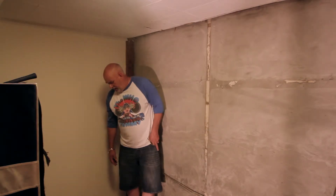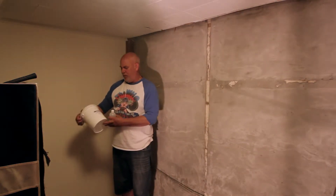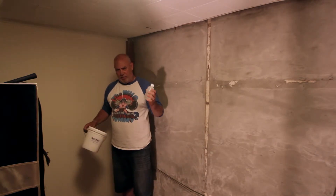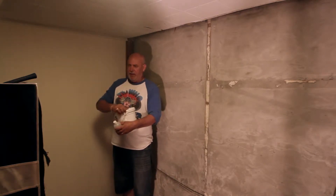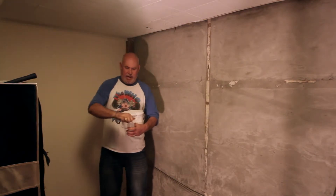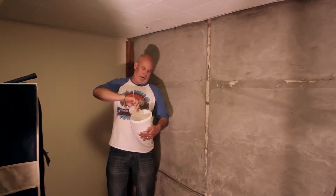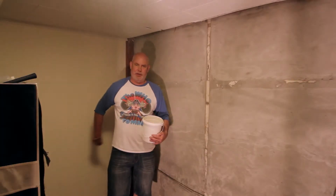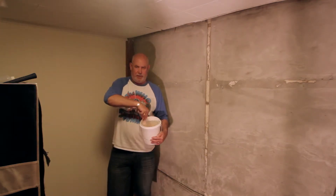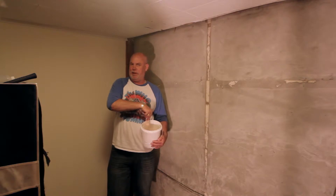It all comes in two parts. We've got the primer which has a part A and this liquid is the part B. I'm going to put the entire amount of both together into this bucket — just pour this two-part primer in here. This stuff does smell kind of bad, but not to worry. Then you simply get a paint stir and stir it around like you're making pancake batter, for about five minutes. I'll come back in five minutes after I've stirred this up and show you the next step.